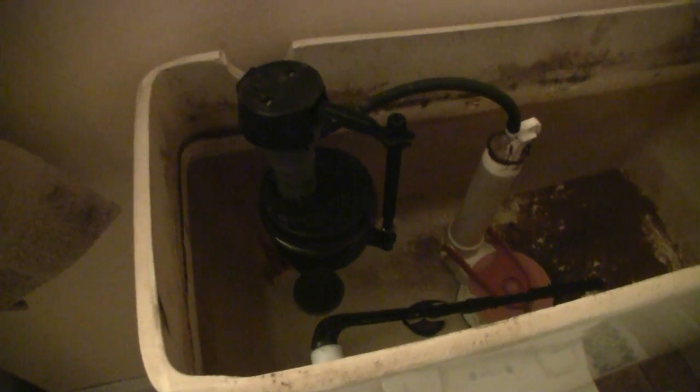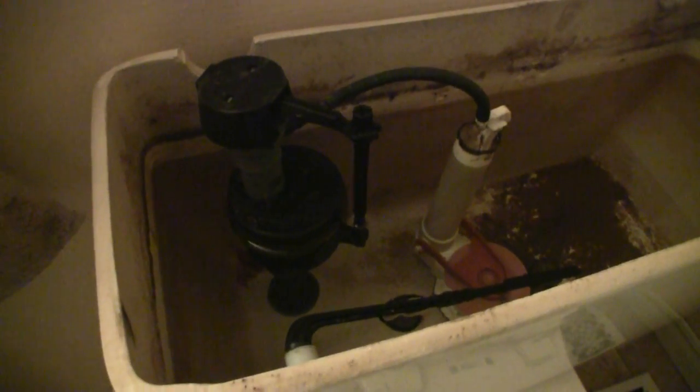Right, here's the old toilet — nasty little toilet. So we shut that one down and we'll take this lid off. You can see what we've got to do. See there's all the silt and stuff that comes in — muck and rusty stuff out of the pipes — and it gets into the fill valve. Sometimes you can take this top off and flush it out, that's what I tried to do, but this one's old and the rings are gone so we've got to replace this little bugger. First thing is to get rid of the water. What's happening with this one is it dribbles in very slowly — takes 10 minutes or more for that thing to fill up.